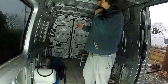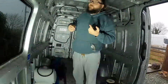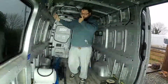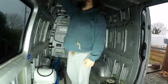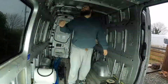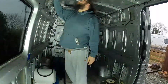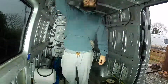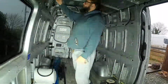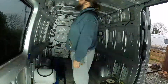I was going to get some T-pieces from Screwfix to finish off these bits on the conduit. One snag I've come across is — although I said the cable can go through the top of this section, this one is solid. There's no way through it. So I've ordered some step drill bits which are coming tomorrow — cheers Amazon. I'm thinking I'll drill through this so the conduit comes out, runs through there, comes back out and goes back into this panel, because the rest of it can just carry on up there. It's a bit of a pain but I can get the conduit to here, leave enough out so I can drill and feed it through. It's not that much of an issue really.